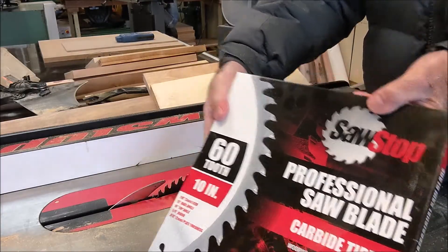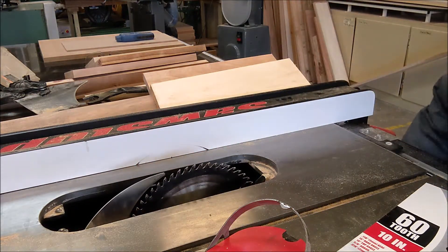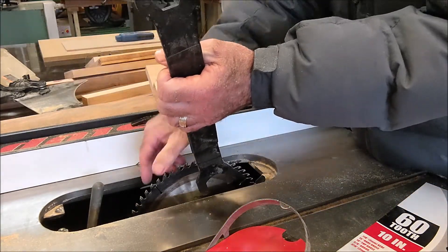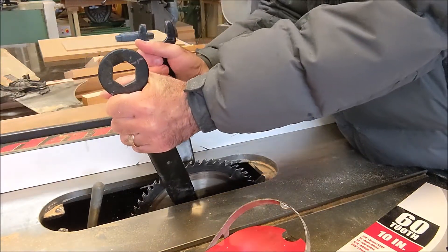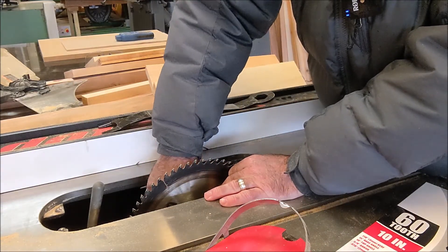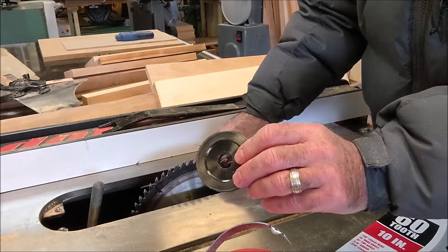Here's my new blade. This comes out — magnetic door in here. Make sure there's no bevel. You can bring the blade up a little higher, and then take out the splitter. There are two attached wrenches. Turn the vac off so you don't drop the nut into the central vac system. These are compression washers — they're designed so under pressure they flex a little bit, and that's what stops the blade from spinning on the arbor.